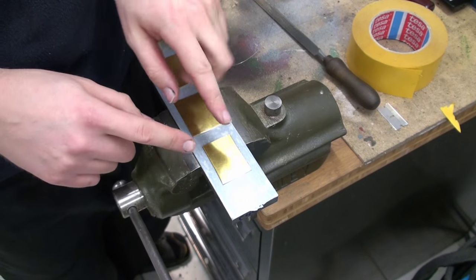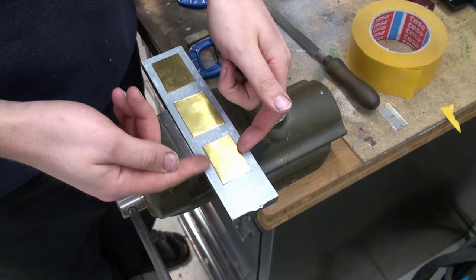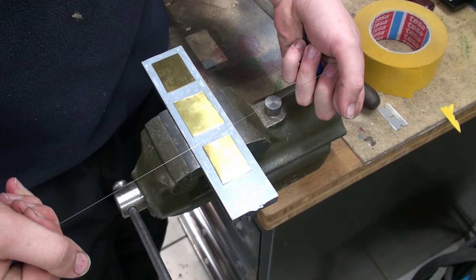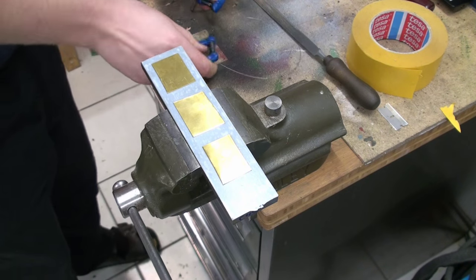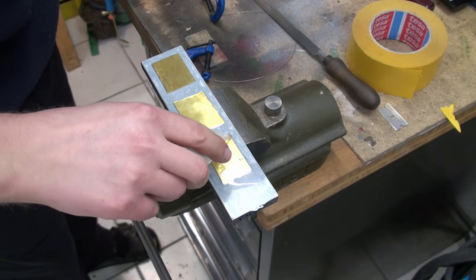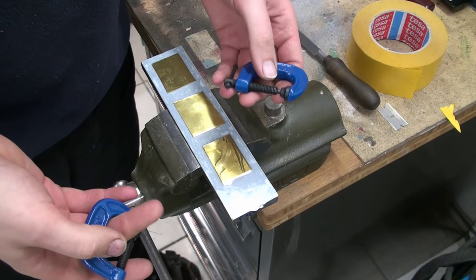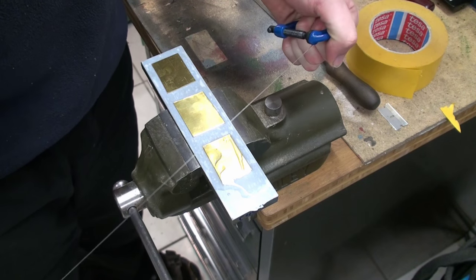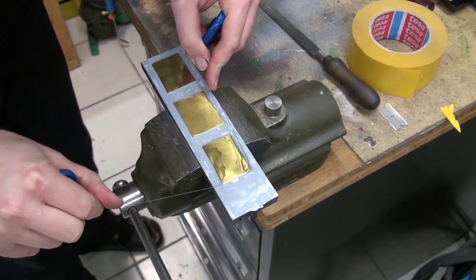Sean Hawkins mentioned using dental floss pulled under the sign and cutting it loose from the double stick tape, or piano wire. Just going under and pulling it off. But I will support it with a bit of alcohol too, just to give me a fighting chance. This is just a piece of 0.4mm piano wire or spring steel wire held in two C clamps to give me a grip. I'm just going under the edge of the piece